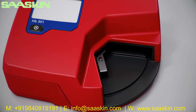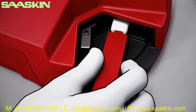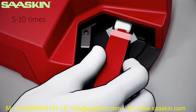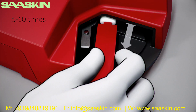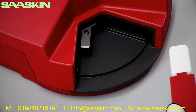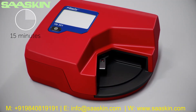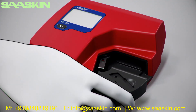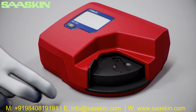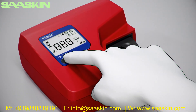Cleaning the optronic unit: clean the cover glasses by pushing a cleaner swab into the opening of the cuvette holder. First move from side to side, then push in and pull out. If the cleaner is stained, repeat using a new swab. Wait 15 minutes before placing the cuvette holder in its place. Make sure that the cuvette holder is locked into place by the small catch. Your analyzer is now ready for use.